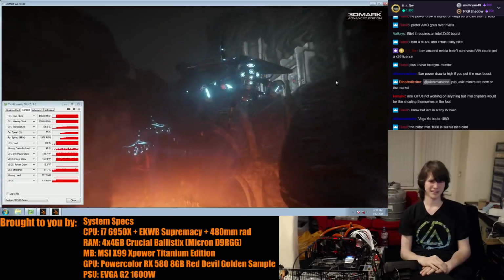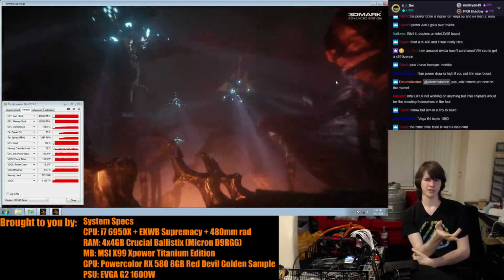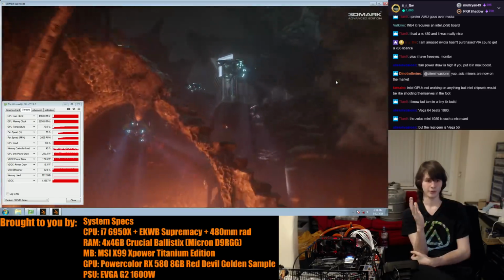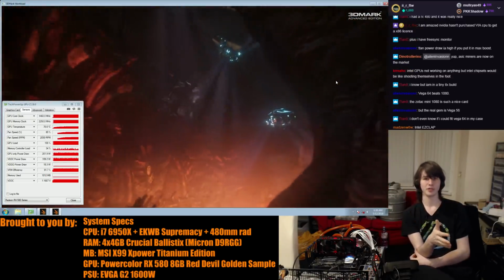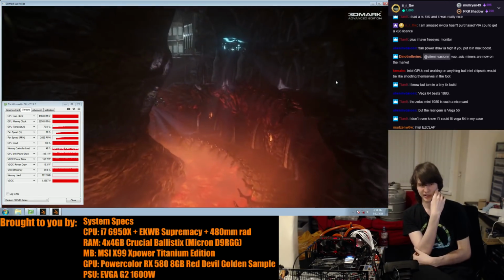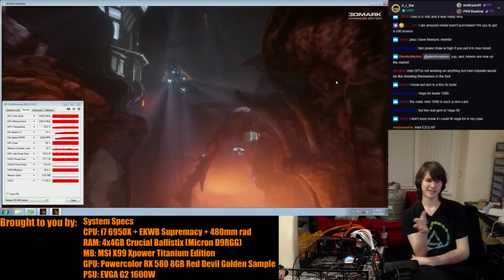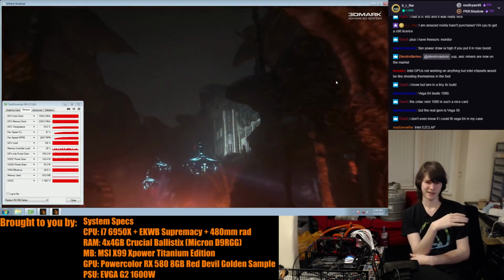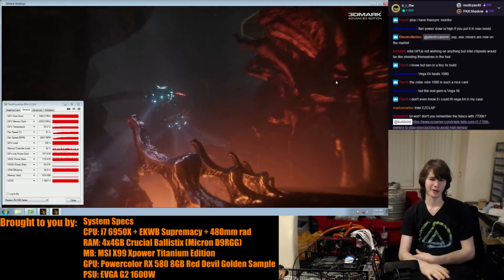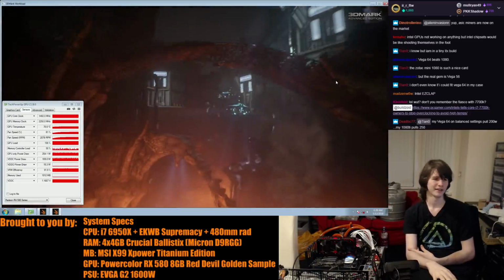Whereas on the GPU side, the overclocking support is awful, because your GPU dynamically changes memory timings. Somebody like NVIDIA or AMD could make it completely possible for a utility like Wattman to reprogram GPU timings on the fly if they actually cared about doing that. It should be within their capabilities. And Intel would probably try to make that work. AMD is just like, nah. NVIDIA is just like, nope, not at all. So if Intel did a K SKU GPU and gave you way more overclocking utilities than everybody else, I'd be totally cool with it, if they gave it really good overclocking support.